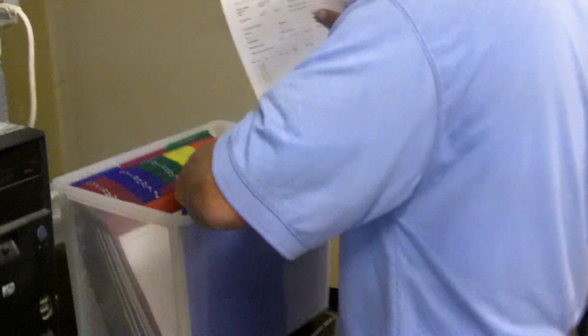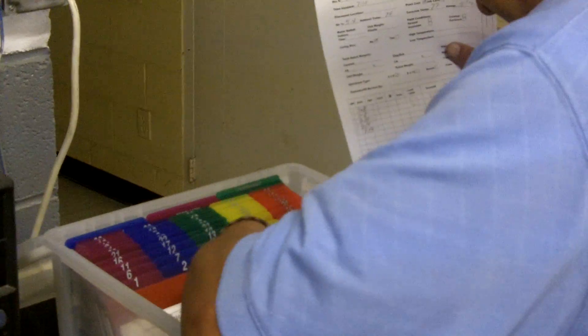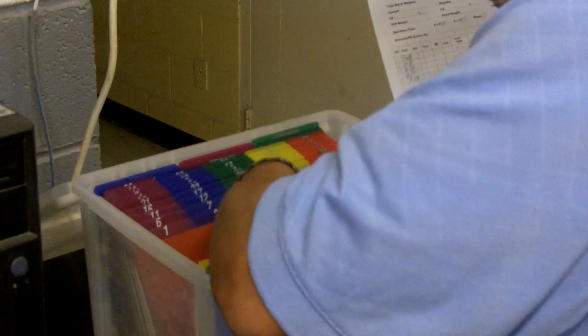We're going to go over here and check out PC-1, find out what kind of design mix we had. The date is 10-22, so that's just a couple days old. That cylinder dated 10-21 would make it five days old. Yeah, it's a 3,000 PSI mix.